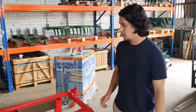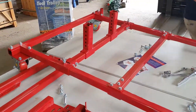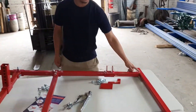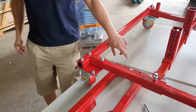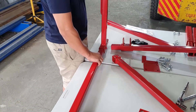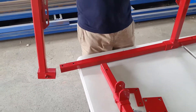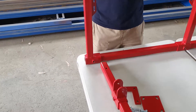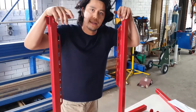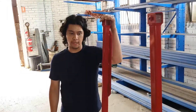We're halfway through building our frame. What I've done is I've put the brake on and lifted it up to give us a little bit of leverage because we're going to have to lift this part up and put the wheels underneath. Before you mount the front of the frame, you'll need to slide the radiator support pieces and telescope them over — we'll do that now. For this next part you may need a friend to help you out just to hold these pieces. Looks a little wonky but we'll tighten everything up now.